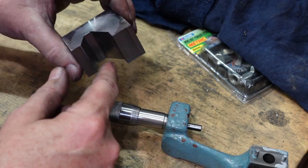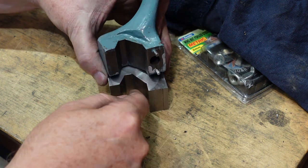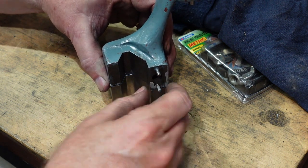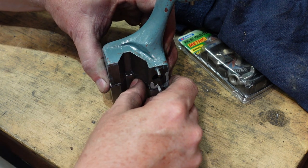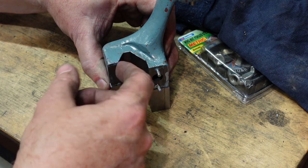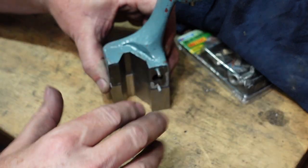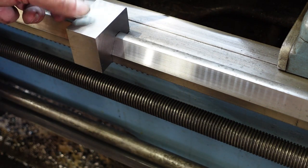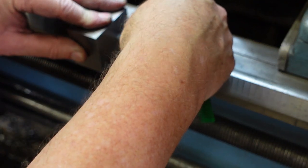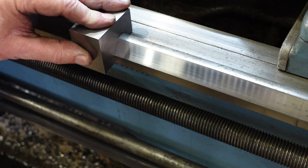That let me do a bit more mucking around than I hoped it would. I seem to have that angle pretty right. I did have to take this back a little bit so it would sit on there properly. When you think about it, you're asking that plane and that plane and that plane to coincide, which is going to be a difficult thing to do, but I can line those up now. That feels pretty good. If I bring it over here to the lathe and put it on, it fits quite snugly. This is a 0.05 millimetre feeler gauge, and I can't get that in there. I can get it in a smidge there, and a smidge there - so that's pretty good.